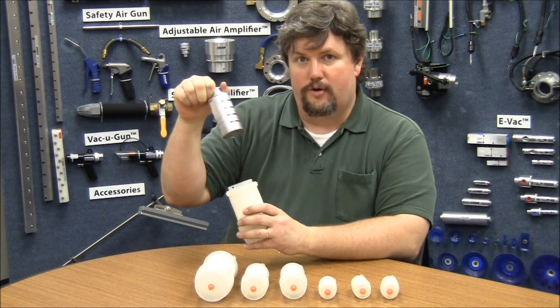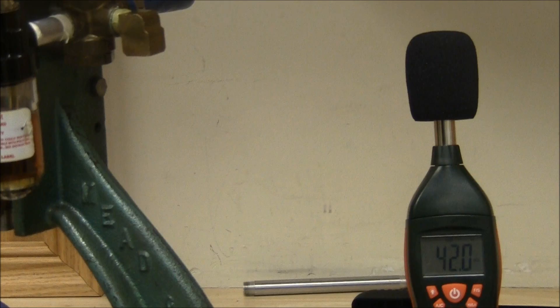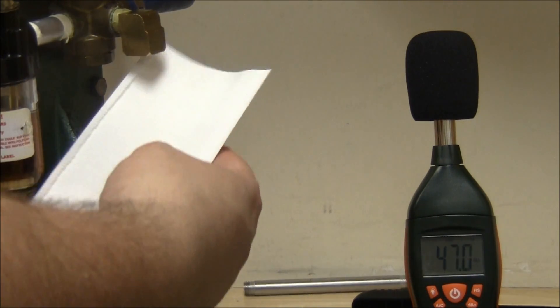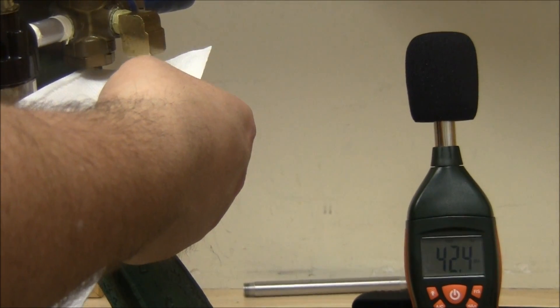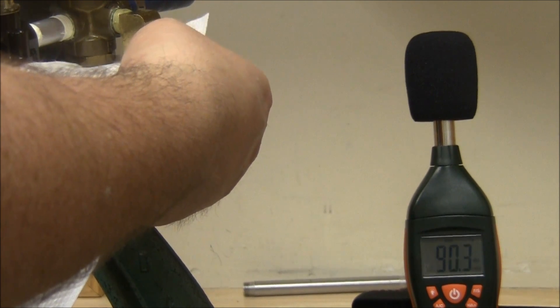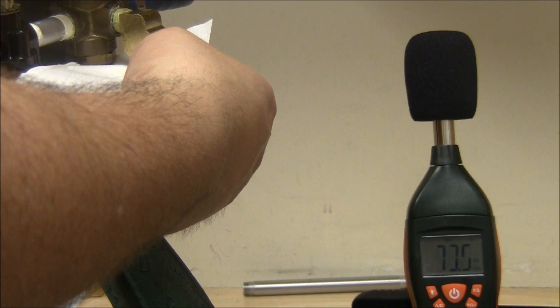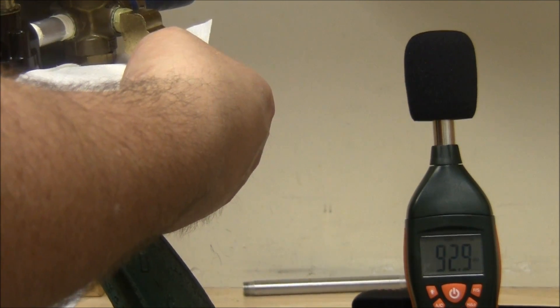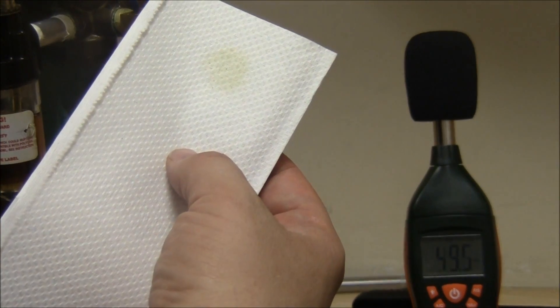Our reclassifying mufflers have a heavy-duty muffler at their core and they add a removable fibrous element. A compressed air system equipped with lubricators for pneumatic tools and air-powered devices can exhaust an oil mist into the environment. The lubricator is putting a very small amount of oil in the line, some of which is discharged through the solenoid valve exhaust port. Note the peak sound level of over 95 decibels here. With just a few strokes, we've had a visible amount of oil discharged into the atmosphere.